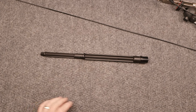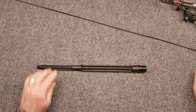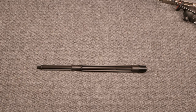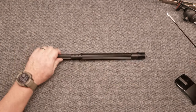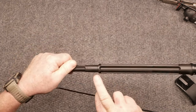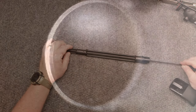The barrel extension has M4 feed ramps there, as you can see. I'm going to use my borescope here, and I have not run anything through this barrel. This is how it came to me from the good old boys over there at X2. We also have these little index points where you can have your opposing screws on the opposite side of the exhaust port. As we move this borescope in here, I want you to see where the lands are jumping.